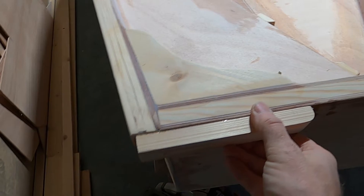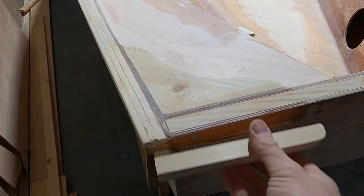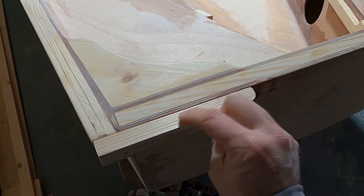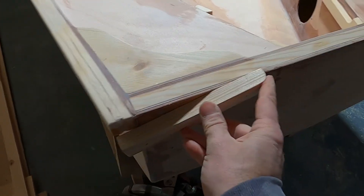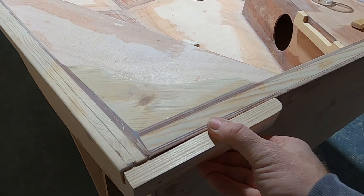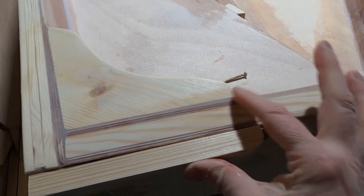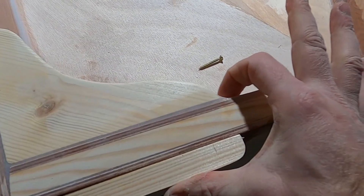I've made these little ends at the rear side. It's not mentioned in the manual, but I think it looks nice and helps prevent this corner from getting damaged. I will install this rear gunwale as well. I rounded the corner, made it as evenly thick as the gunwale, and let it end the same length as the knee. After installing, I can round this edge with thickened epoxy as well.